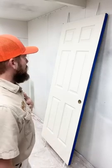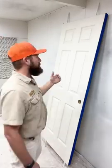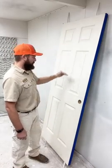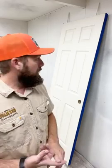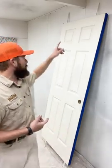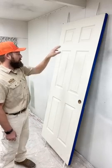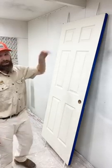Now, with paints nowadays, they dry very fast. So typically what I'll do is do a modified version of that where I'll do the 2 panels and then bring the rails and stiles. 2 panels, rails and stiles, 2 panels, rails and stiles. Houses are heated, and in Minnesota the air gets really dry. And typically when I find using either wall paint or even Emerald Trim Urethane and things like that that dry quickly, by the time you get the panels done, it's already starting to dry on top. So again, you do what you think is best for your clients. I'm going to show you the way that I like to do that basically guarantees a good outcome every time.